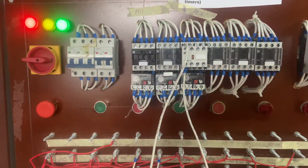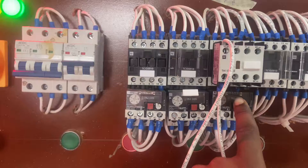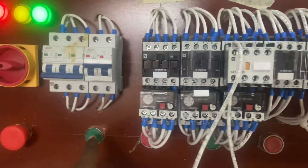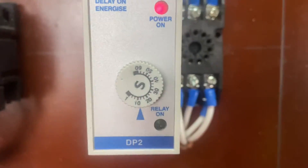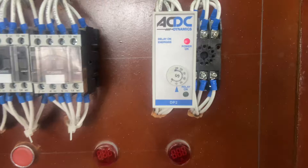Motor 2 is now in. Now we're testing if the overload is going to work. Let's try the overload — you can see everything has been de-energized. Then Motor 1 restarts. I could have set less time, but let's go with 10 seconds — waiting for the 10 seconds.